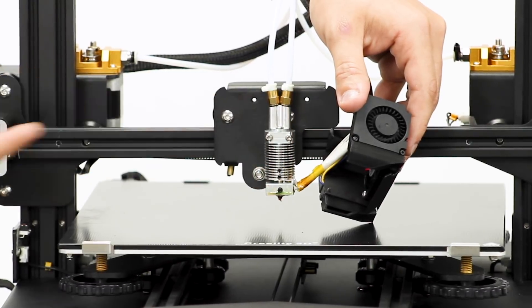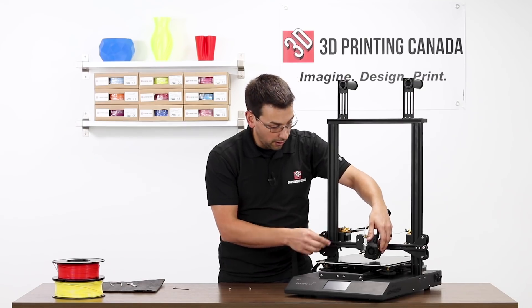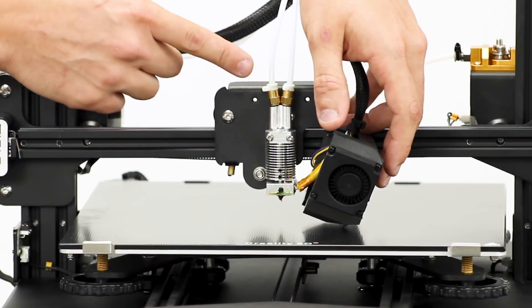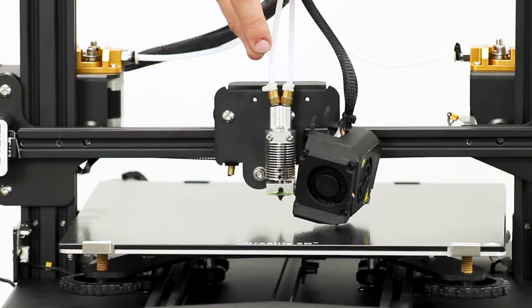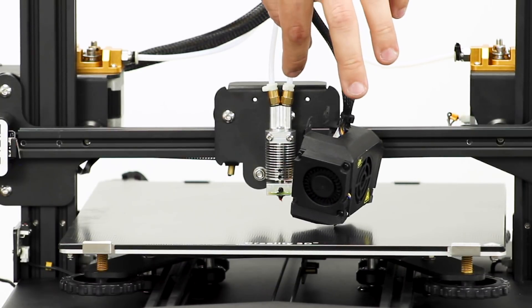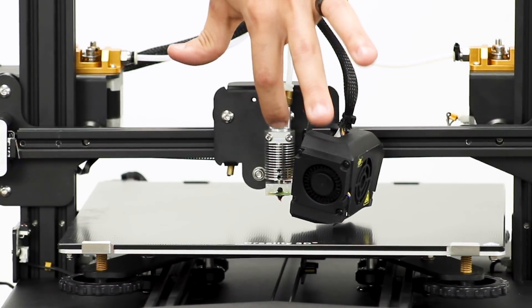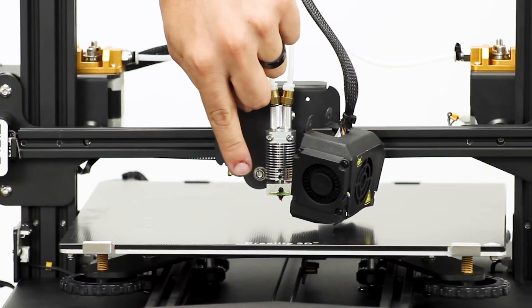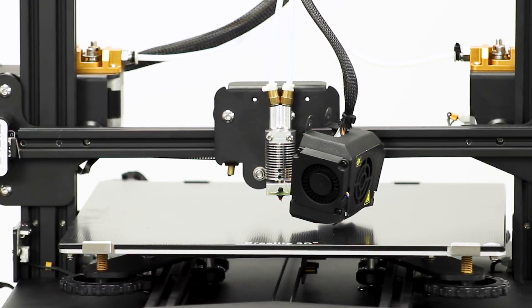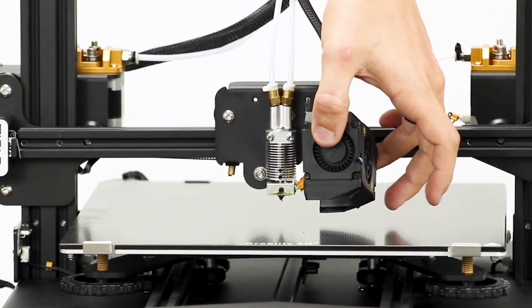It comes equipped with a standard 0.4 mm nozzle and attaches to the X carriage the same way as the CR10 and Ender 3 — just two screws into the back. One thing to note: it's a bit finicky where you position the filament in each side when starting. If starting with extruder 1 followed by extruder 2, you want each filament just below the couplings — right about at the end of the brass — so they're not colliding where the two tubes join. When slicing, you'll set how far to pull the new color in and how far to pull the old color out when switching. We'll cover CRX slicing in a follow-up video.